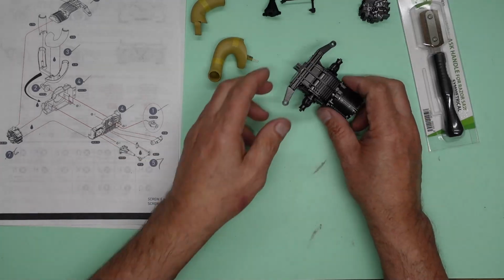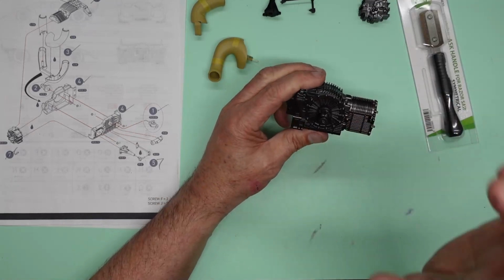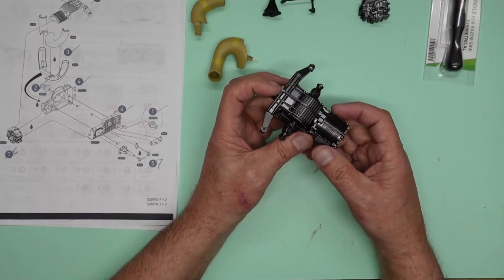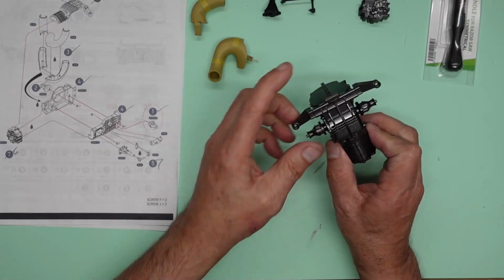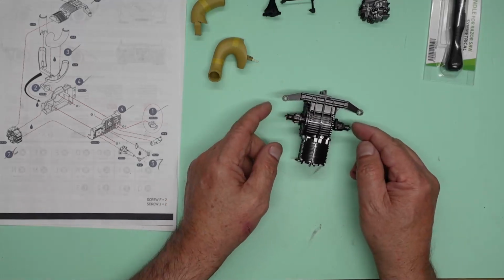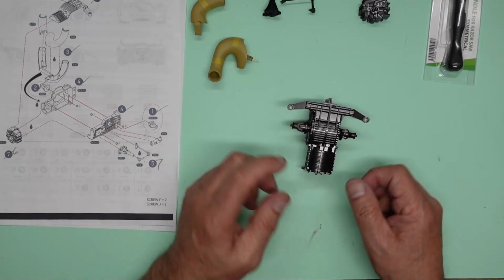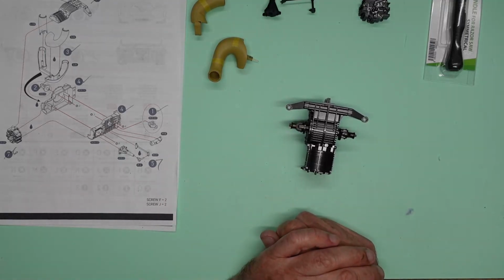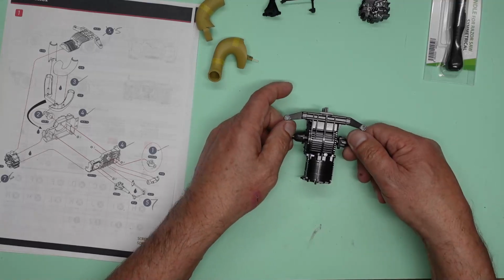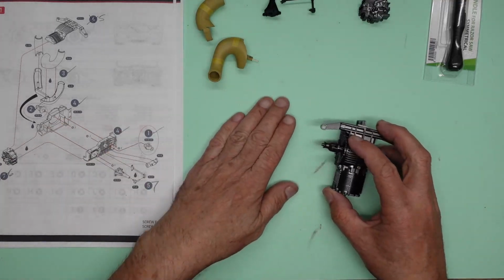So I think that'll do us for step one. I may do a step 1A sort of midweek and show where I've painted this and everything and the little mods I've done, but we shall see. But basically, I've shown you now what you can get from the box, shown you the alternatives, and obviously also what we're going to do with those shafts. So I don't know, I may give it a go at that. I think I've got some 2mm rod. I may see if I can cut a thread on some 2mm rod and actually thread those on and have them screwed in together, and that way I can fit them after we've put the gearbox together. We'll have a look at that. Thank you for watching. I'll see you all soon.